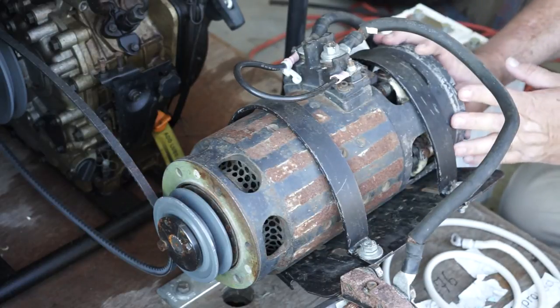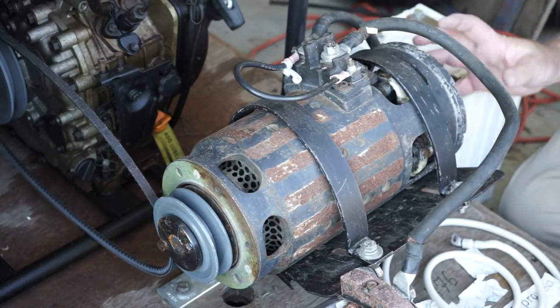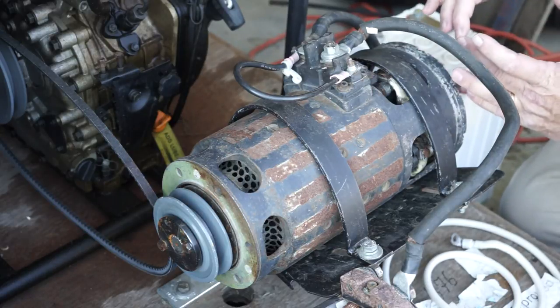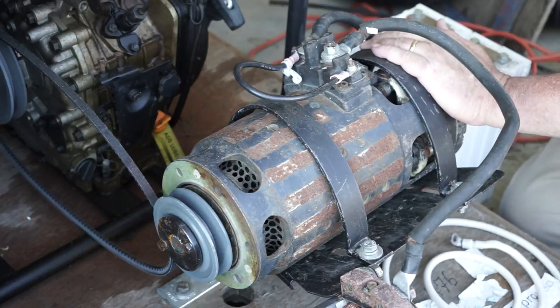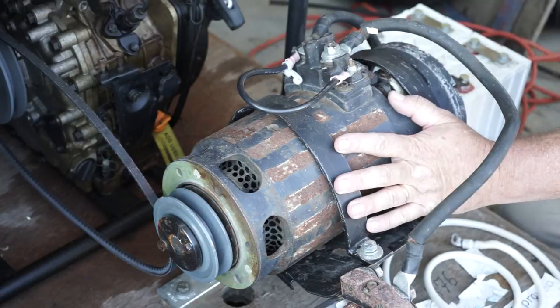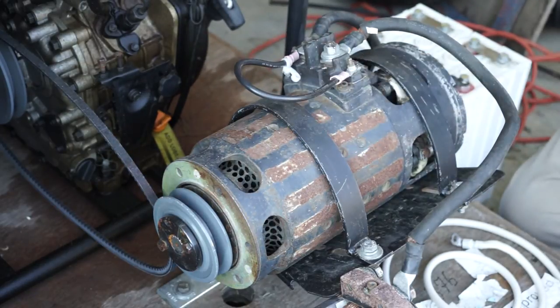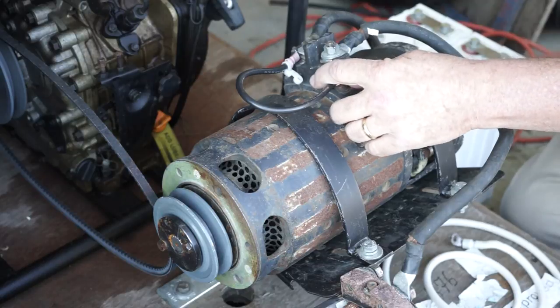The back end of the motor is open — at least on mine — not just into the brushes but on the very back side. There's actually a cover that goes over these things with a big hole in it to have a big blower that blows air in through this thing. These motors need a lot of air for cooling when you're running them. With the field connected there's a lot of torque, but you have to get good voltage to it to run fast. Without the field windings — field weakening — that's the basic premise on a standard sepex motor: reduce the voltage to the field and the motor speeds up.